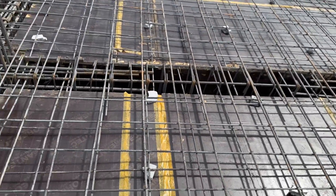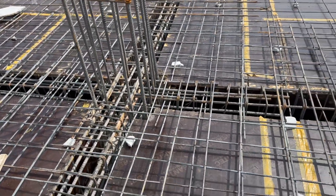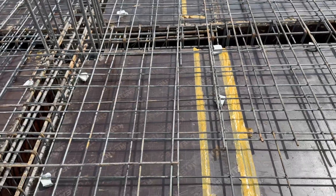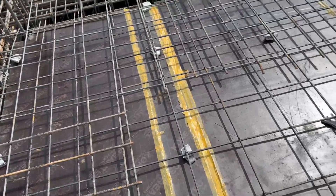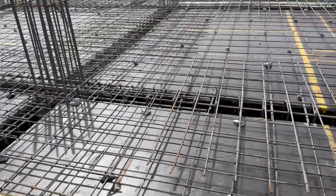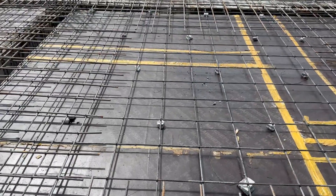On the top of the beam you can see clearly that inside this beam they provided lapping, which is about 12 inches in length. This is not sufficient. You are not allowed to provide lapping at a distance of L/4. Unfortunately, they did exactly that.